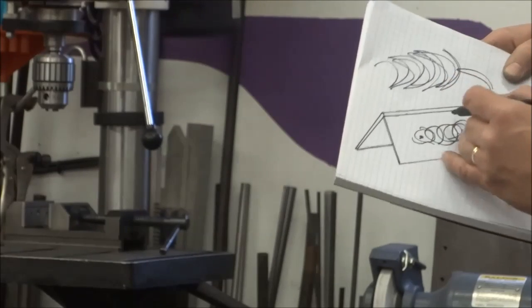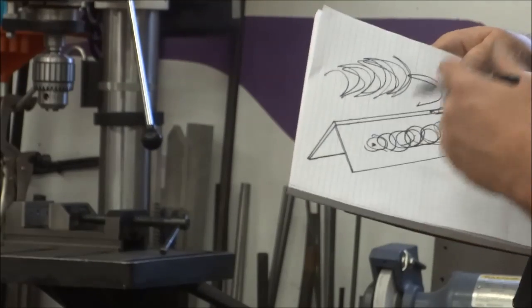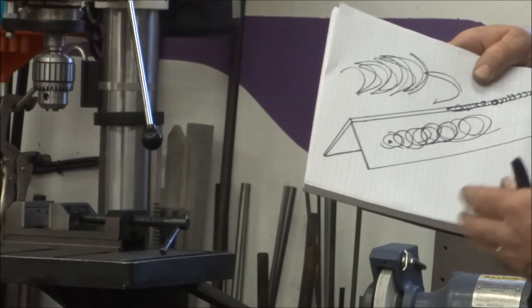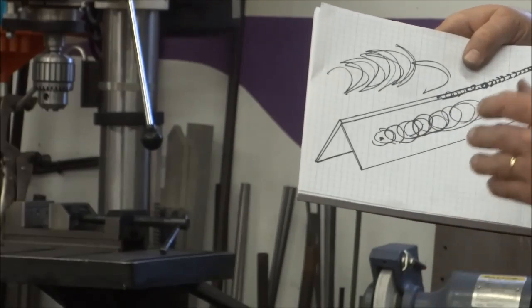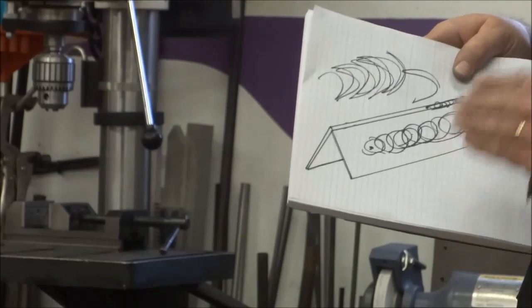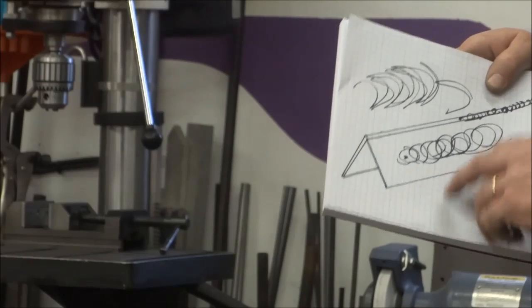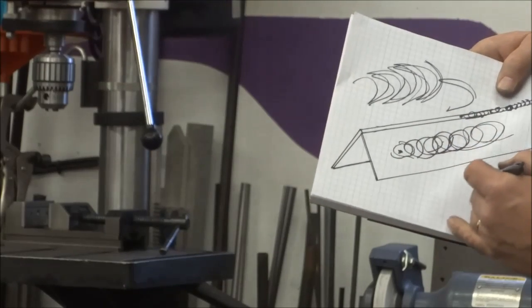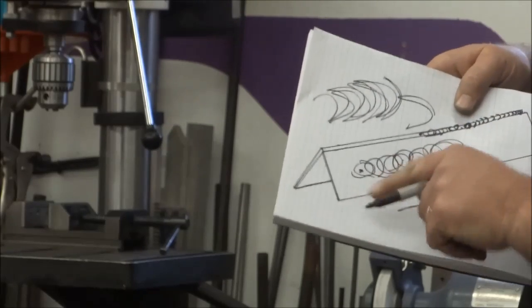If you're just making big loops and you're going back over the top of yourself and you're going over the root or the deep part of the weld, you're not creating a sound, solid weld. This technique is not to be taken lightly because you still, first and foremost, have to have a solid, sound weld. It's better to learn and know how to watch the puddle, watch it bite in. Even if you go forward and then come back half that distance, and you watch it bite in.